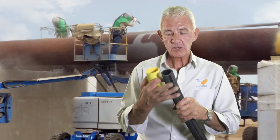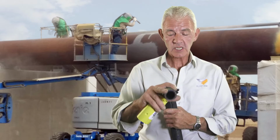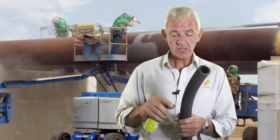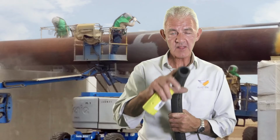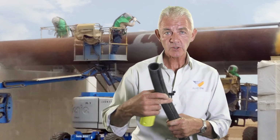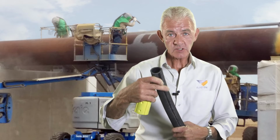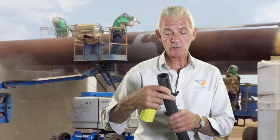Importantly too with the blast hose, when the blaster is operating the blast hose, if he at any time pushes the hose to a severe radius, the hose wears prematurely near the operator, which is deemed extremely unsafe. So just make sure that your blasters keep a good radius of the blast hose when operating the hose, and also the radius from the blast pot.